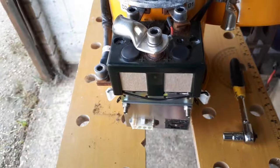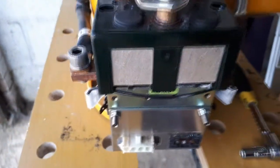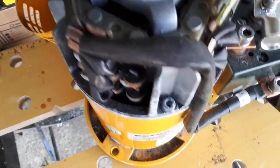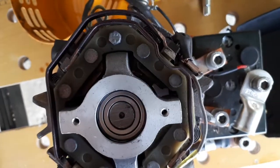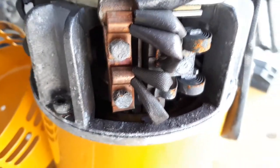You take the cover off the solenoid section on the side of the motor. At the top there, I've put a connector on — that's where the positive connects to. Down here the white block is where the bow thruster controller connects to, and there's also a fuse down there for the electronics. I'm pointing out where the brushes are — you're supposed to keep an eye on them, supposed to be 14mm wear on those, which looks okay I think.